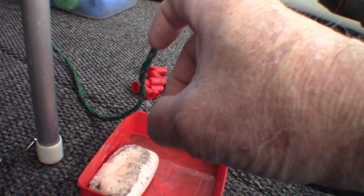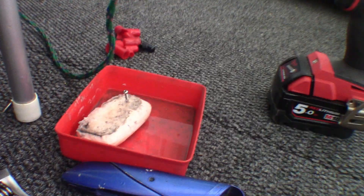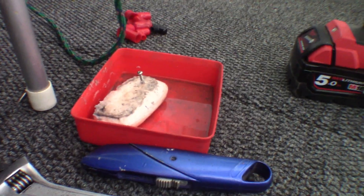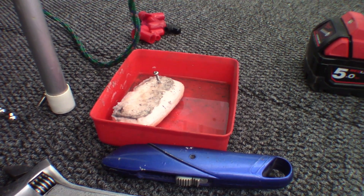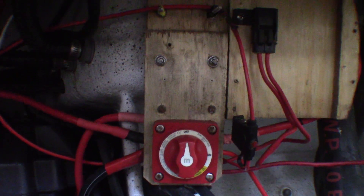Here's an old carpenter's trick: if you've got screws that might be hard to go in, wet a bar of soap so it goes all slushy and then scrape a bit of soap onto the screw — it will lubricate it and make it a lot easier to go in. If you don't do that with a really thin screw you run the risk of snapping it as you're screwing it in. I'm going to screw this in without the camera because I need both hands for this job, so I'll put the camera down and come back after it's on.